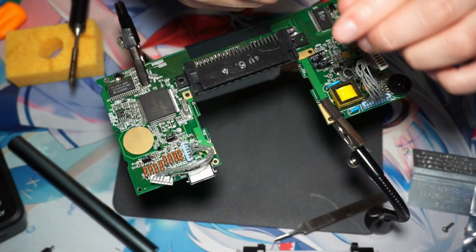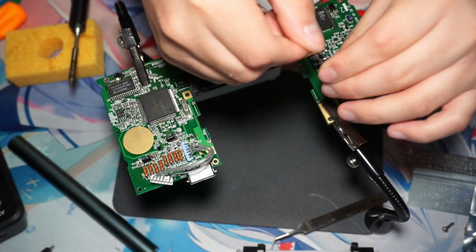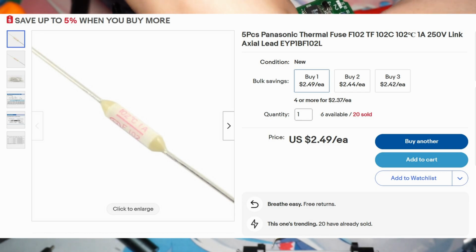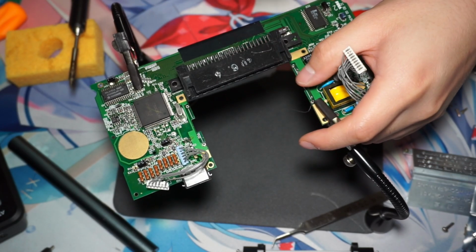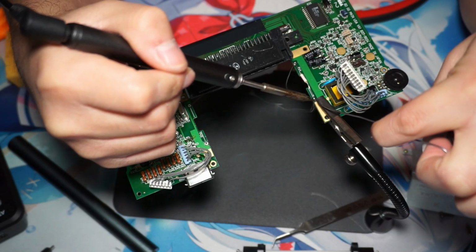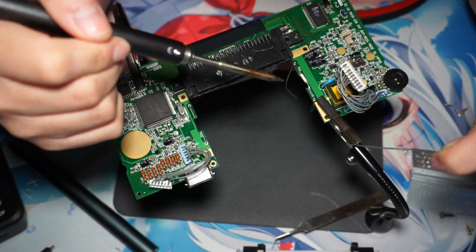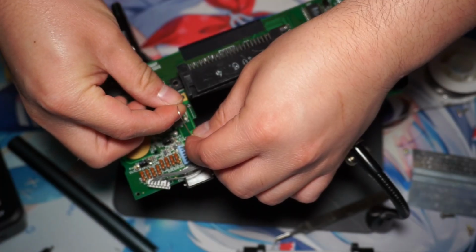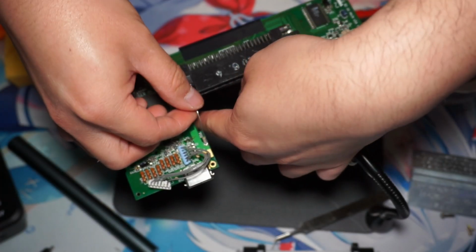So these are the new fuses that you should get. They are Panasonic thermal fuse, temperature 102 Celsius, 1 amp, 250 volts, axial lead. I'll have a link in the description for all of the products that you need to replace this. Again, depending on your model, you need to figure out which Game Gear that you have.